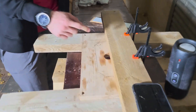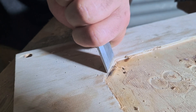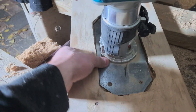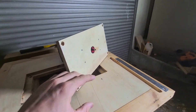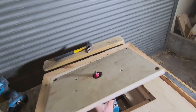Because the thickness of the wood plus the metal is too much for the bit, we mark it with a pencil, take it out, and then route out the whole thing so the thickness is smaller. We set the gauge for the first pass a bit small, then go even further. We first routed out about 0.5 centimeters, then cleaned up with the chisel. Now it's flush, so we need to do the same but to more depth. There was a lot of friction because it was exactly on the line — accurate, snug. Now we need to screw it from this side to the plywood. It's a bit of a rough solution because we ate a lot of the material — it's really thin — so we put a screw from this side and a piece of wood from the other side catching it. It's really strong but we'll need a better way. The router jig is done.